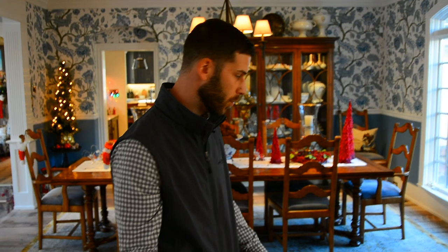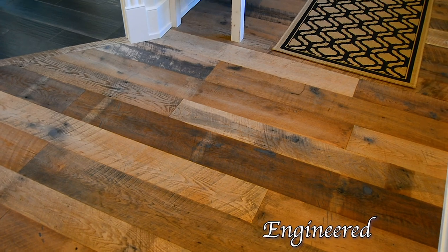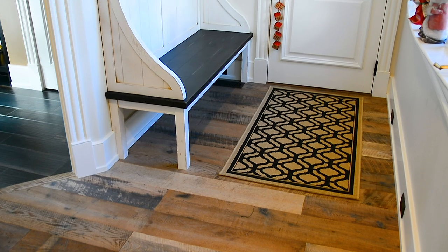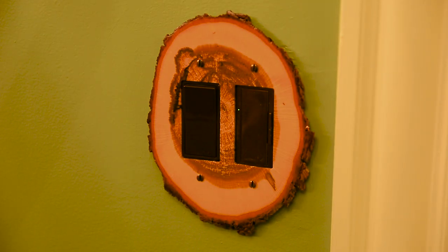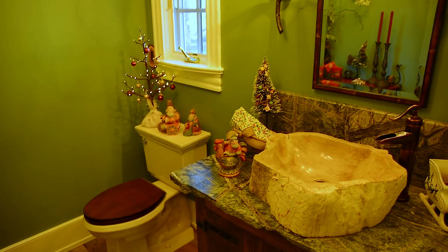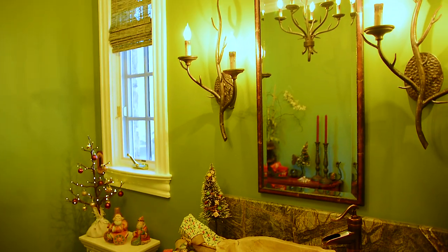What's really cool about that, outside of it being a very green product — sustainability — was the unique appearance that this floor produces. Exterior barn wood only gives you certain grays and warm brown tones. Reclaimed oak will give you certain black patinas in the skip planing produced in this floor. To not change the overall appearance of the floor, to have it as untouched, sheenless, and natural as possible, we applied Bona Natural finish.